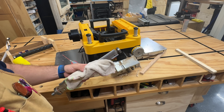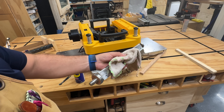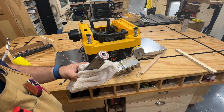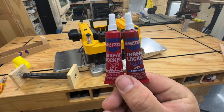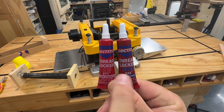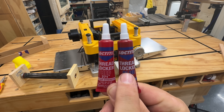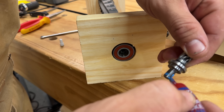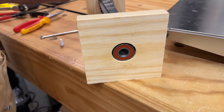We're all done with the removals. If you want to, you can keep the old head or dispose of it — you do not need the bearings or anything else after you have removed the gear sprocket from the end. For attaching the gear head to our new cutter head, make sure you use Loctite Blue, not Loctite Red. The stupid bottles look exactly alike except for this little indicator right here. Make sure you do blue because it is removable. Note the blue color.